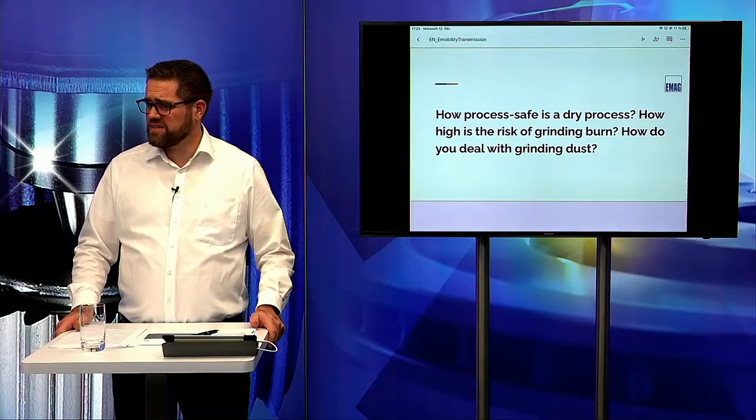Okay, and one more question: how do we deal with the grinding dust? We have a vacuum system for the big chips. We have a chip conveyor below the hob, and it transports this to a vacuum system. The vacuum system is also removing the dust out of the machine. And also to have a stable machine, we are sucking air from the factory through the machine bed in lines, through this machine. So this has three different functions: remove the chips, remove the dust, and keep the machine temperature stable,